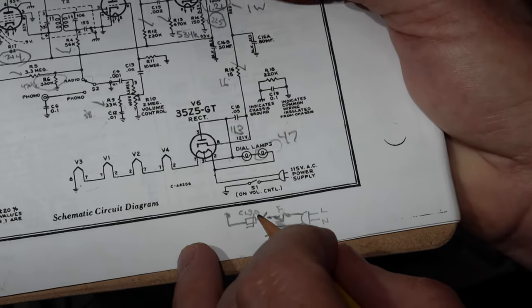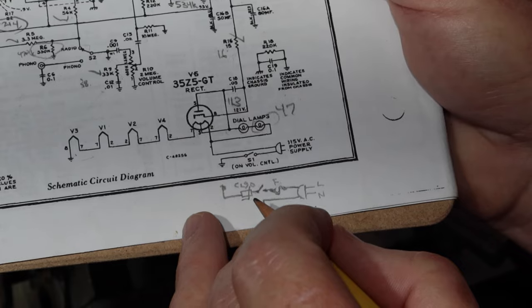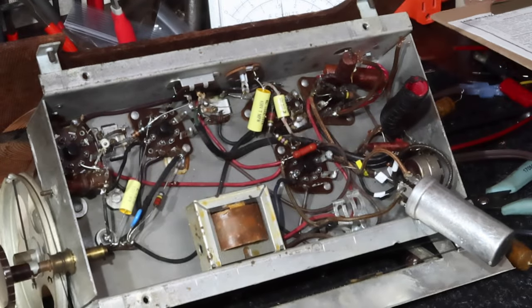Okay, so that's the plan. We're going to put in a fuse. We're going to move the switch location to the line side. We're going to insert the thermistor further along. And so the question is, how do we put this in the radio? All right, so what I've decided to do is,